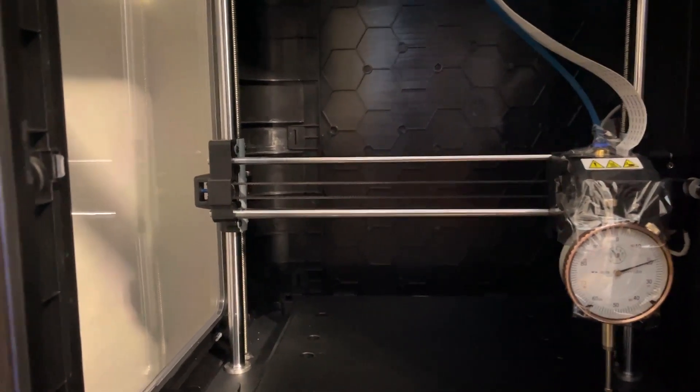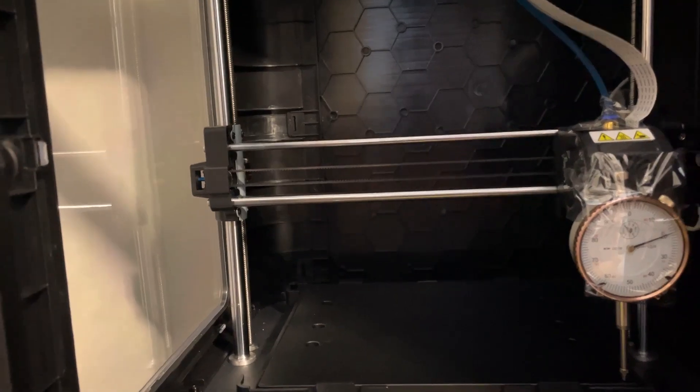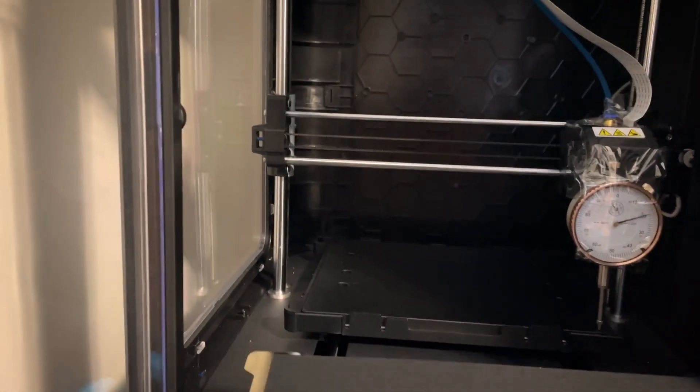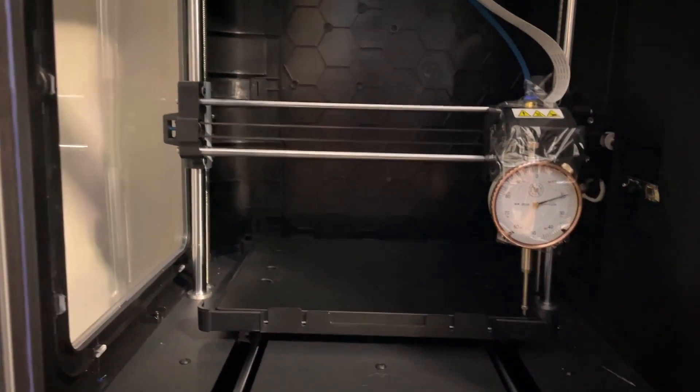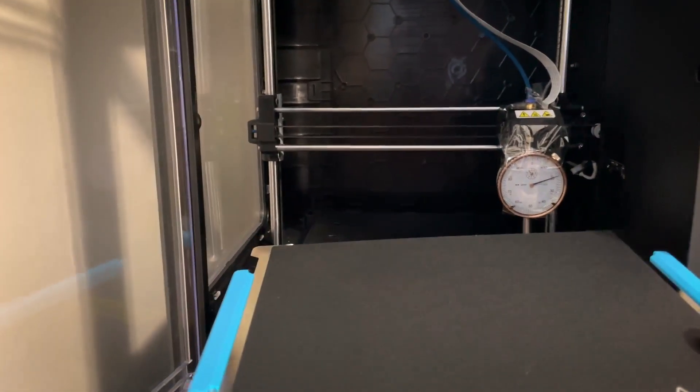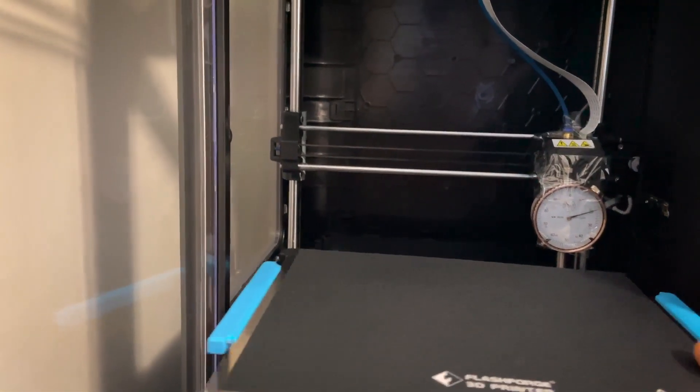When you have a magnetic plate — the plate goes on top of the bed — and you add more distance between the plate and the bed with shims, the magnetic force actually weakens because of the distance. So adding shims weakens the magnetic strength against the build plate. When the magnetic strength is weakened, your print bed is more susceptible to jittering movements during the print, causing it to move and giving you weird layer lines. I hope you enjoyed this video on how to level your bed. I've been sitting here for maybe two or three hours fiddling around with it. I'll leave a link in the description if you want a dial indicator, and also a print from Thingiverse that fits for my dial indicator using a quarter-inch screw to attach to the print.